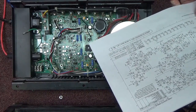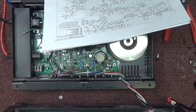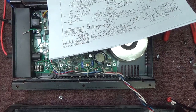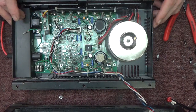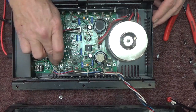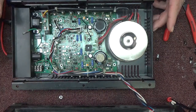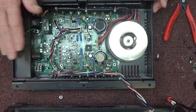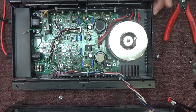It had to be something common to both sides, and as far as I can tell these amplifiers are completely isolated from each other. This muting section is pretty much the only thing common to both sides. So the moral of the story is: when you're working on older equipment and checking capacitors, do not ignore these little guys. I did replace all the rest of them in here — none of the others were horribly bad, some were an ohm or two, and there's a whole bunch of them: tens, forty-sevens, and four-point-sevens. But this one was bad and it caused the problem.